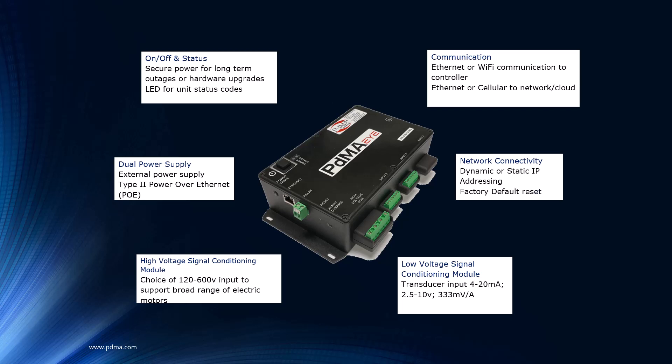We can accept up to 600 volts in our high voltage SCM. One of the interesting things is our portable technology went to 1,000 volts — we went from 600 to 1,000. With the PDMAI, now we're full transducer capable. We really have no limits anymore — all the way down to DC, and anything higher than 600 volts is going to be transducer. So it's very flexible. And it's 12 channels, giving a tremendous amount of opportunity to put in auxiliary inputs, RTD, things like that, as well as line-side and load-side drives.